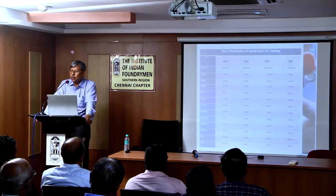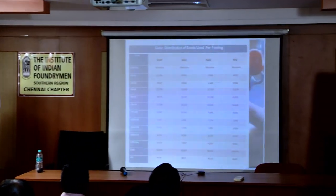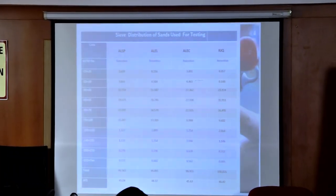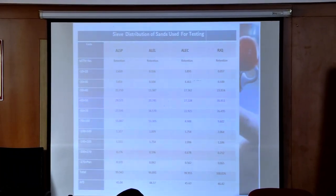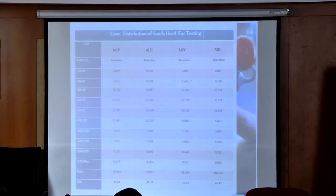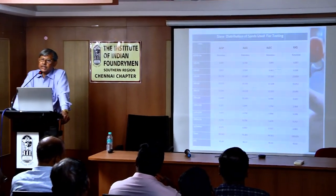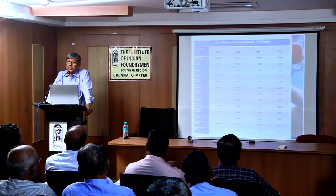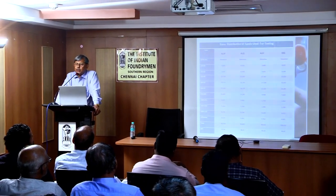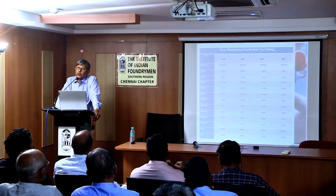So now is the concluding part, the sand test, which I have already told you. In most of the cases, we specify the AFS number of the sand and we tell that at this AFS number, 10 should be given. But you must have experienced, AFS number is part of a big story.